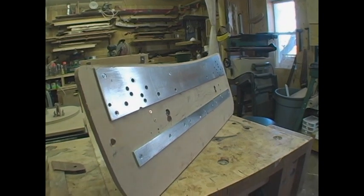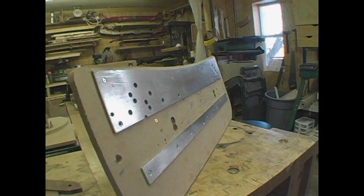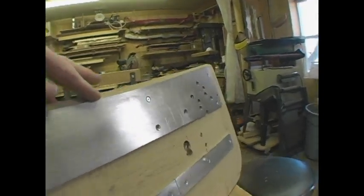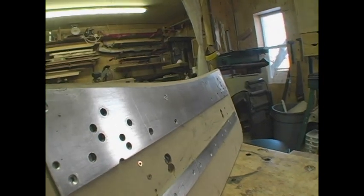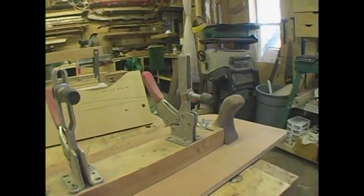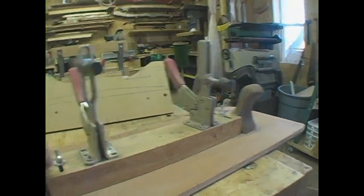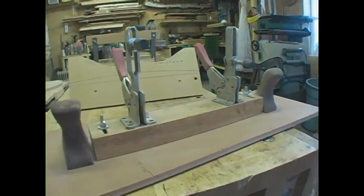On the riser jig, the bottom side has two plates of aluminum, an eighth of an inch thick. I made this aluminum into a perfect curve to fit a 64-inch recurve bow's riser. That rides on a table, and one edge rides up against a guide edge. The handle clamps down in here after being band-sawed, then we go to the sander — I made handles for it to keep it easy — and sand it down so it fits the form perfectly.